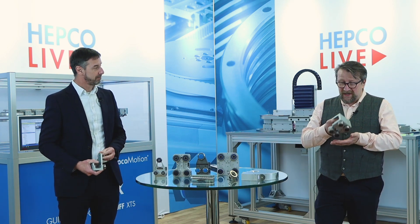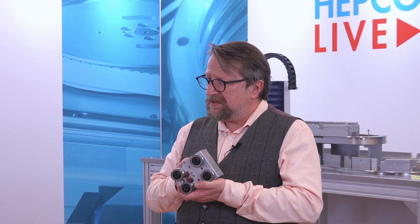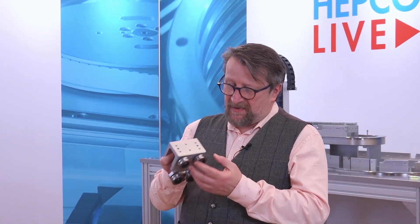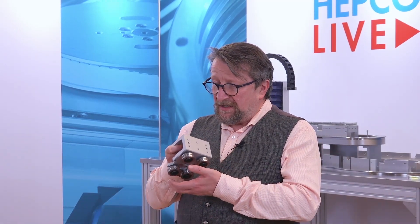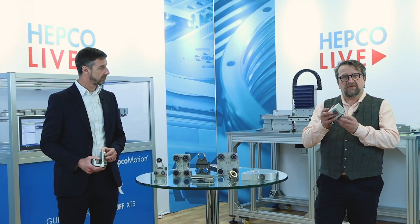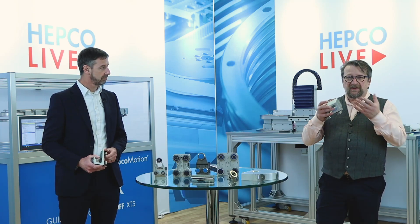There's going to be some sort of trade-off. If it's heavier, you can't move it as quick — that's exactly it. This larger mover is 40% heavier than a standard mover. The bearings are much larger, and the overall mass obviously precludes high accelerations. We've got the rotating mass and the overall mass of the unit, but we're talking about big payloads, so we're not expecting to see agile-type accelerations on 20 or 30 kilo payloads.